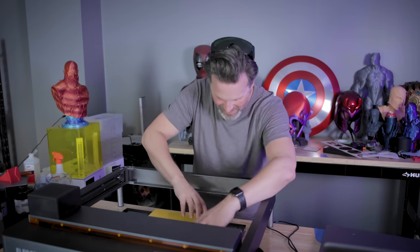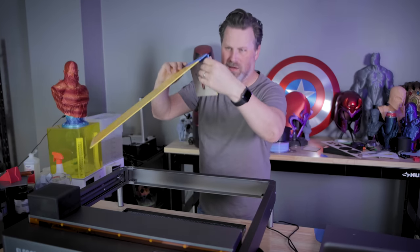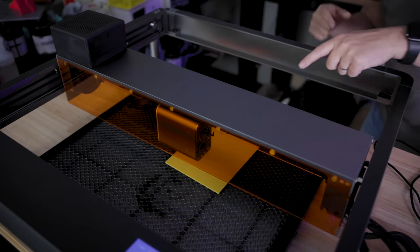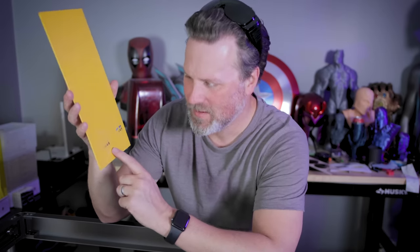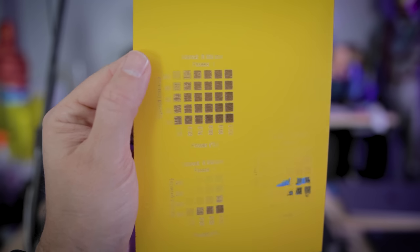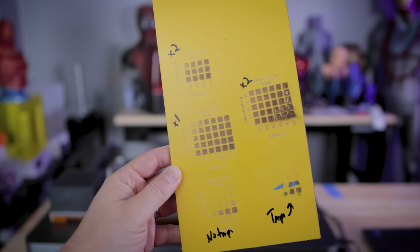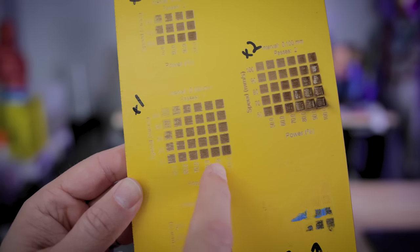Let's see if this worked. I used a little masking tape to see what the results might look like. Actually, that worked — removing the tape revealed it cut pretty well, trimming the three millimeter board down to a more accurate scale size. I could reuse the scrap piece to run more tests with and without tape to find the best settings. After running a whole bunch of different test series, I found that the one-interval setting works fine, and 70 millimeters per second at 90% power is what I'm going to go with. Let's fire this up.